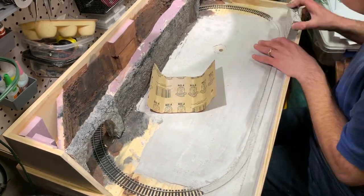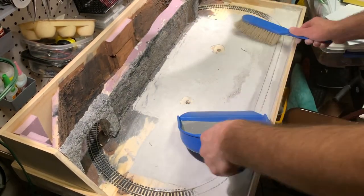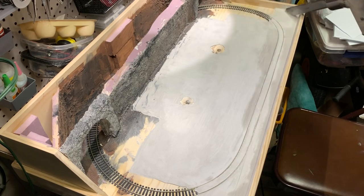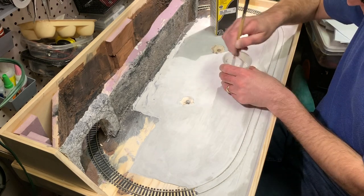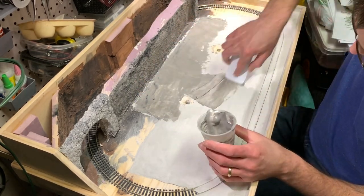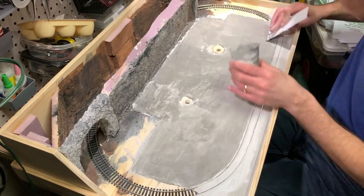After sanding everything a second time and cleaning up, things looked pretty good — still not quite perfect, with some small dips and areas not completely smooth. I could have kept sanding, but I was running into trouble where I'd sand some areas too much and end up with low spots relative to nearby areas. It's tricky to get everything right in one or two coats. In most cases when using Smooth-It I need three coats — that's not a fault of the product, it's just that with plaster in general you should assume multiple coats.